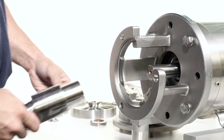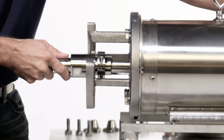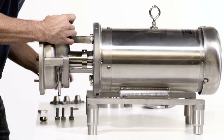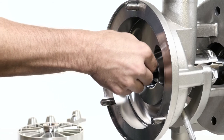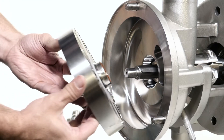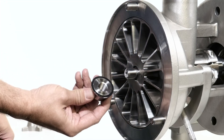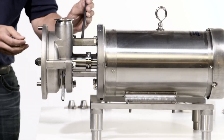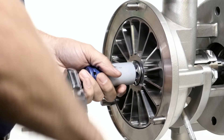Installing the new shaft. Install the shaft collar onto the new pump shaft. Slide the pump shaft onto the motor shaft. The next step is to gap the impeller. Place the pump housing onto the flange support. Install the housing bolts and tighten with a 3/4 inch wrench. Install the pump shaft key. Place the plastic gapping shim supplied with the pump over the hub of the impeller. Slide the impeller onto the pump shaft. Place the impeller nut or impeller bolt onto the pump shaft. Place the 3/8 inch diameter rod in the hole on the shaft. Allow the rod to rest against the flange support to keep the shaft from rotating while tightening the impeller nut or bolt to the correct torque.